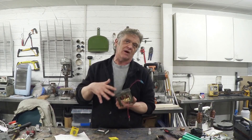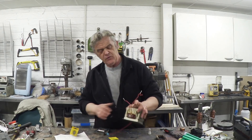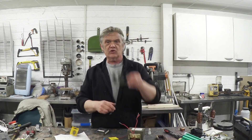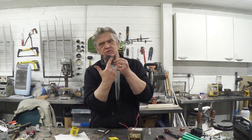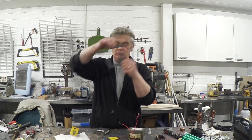With that in mind I've made the whole thing out of one of these, which is a microwave oven transformer, and I've used no welding — all I've done is saw it. If you take off the coils and separate them out, what you get is a whole bunch of E's and a whole bunch of I's, all in one block. If we saw that central tang out, we get something that looks like that, and if we put an I on it we get this metal square.